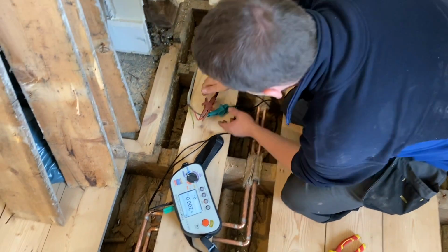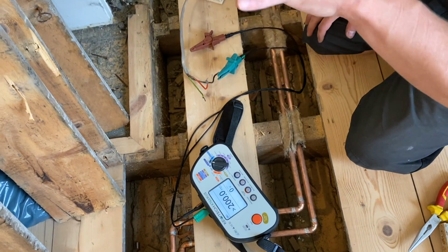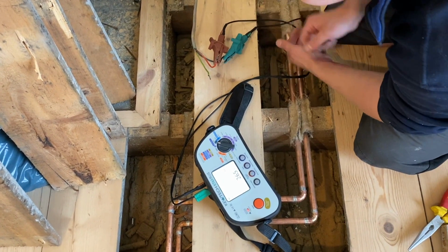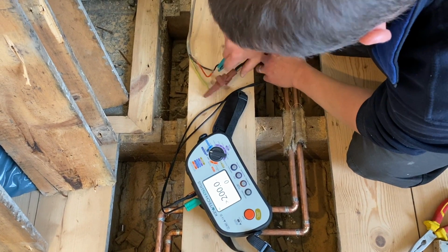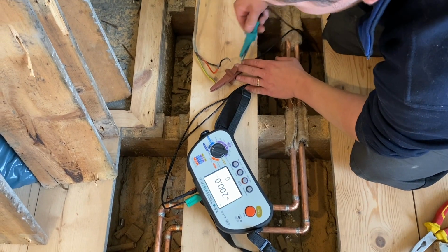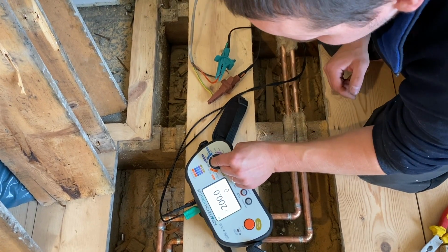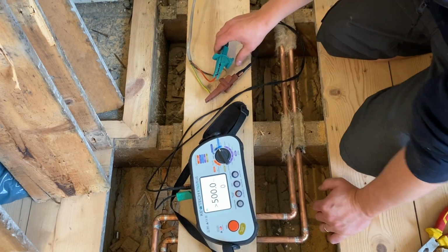Right, we're back upstairs now. We've connected all them sockets back up. We've left that dodgy leg disconnected now. So fingers crossed, we've got a good reading across the board. Great. What we'll do now, 500 quickly. 500, go. See if we can get a good reading.